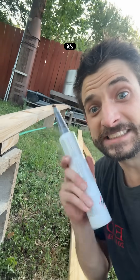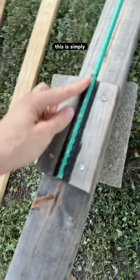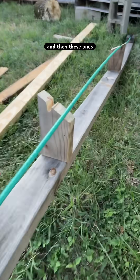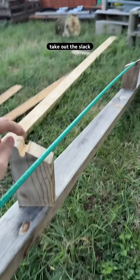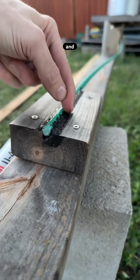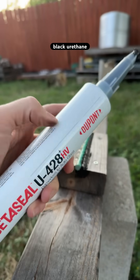Here's the crazy part: it's just glue — this black urethane adhesive. I put a 2x4 here to space it, and these ones are simply added to take out the slack. One, two, and then another set of a glued joint. All I did was take a router and make a half-diameter groove in the piece, then jam it in there with a lot of the black urethane stuff.